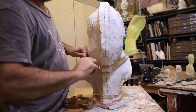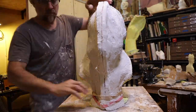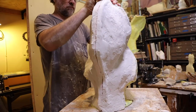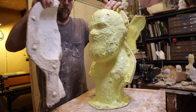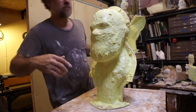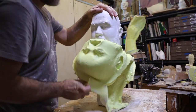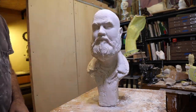After about 20-30 minutes it's set up and I can demold my plaster cast. I take all my rubber bands, bolts, or straps off — whatever I've held the mold together with — and then I carefully separate the mother mold sections. When I have a mold like this, I usually have one piece that's going to peel off easily; in this case it's the back. Then for the front piece, I'm careful to get it out around the ears, peel all the edges loose, demold it — and there's Kevin.